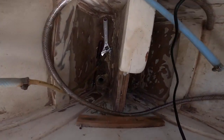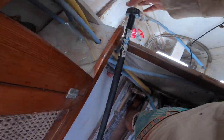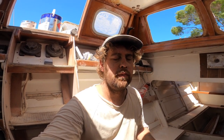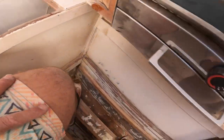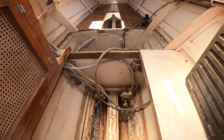What a nightmare, but I got these out. There's a little bit of wet wood in there it looks like, but that's okay. Used a big crowbar to smack them out. So now I can sand all this with nothing in my way. I've ground all that paint off in the bilge and got it back to bare wood. It's taken a long time and I'm covered in dust, but at least that's done now. You can see I've sanded all through here and up to there, and now I can put the thinned out epoxy on the wood sections.